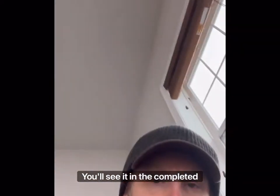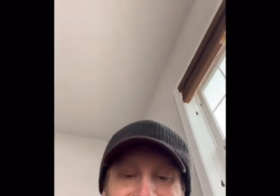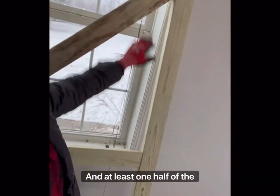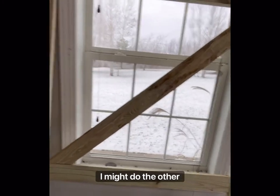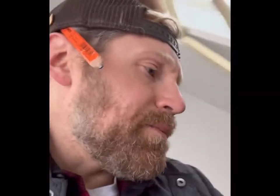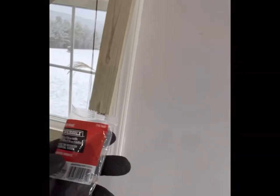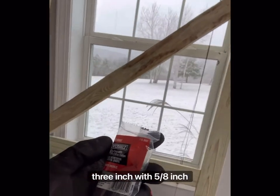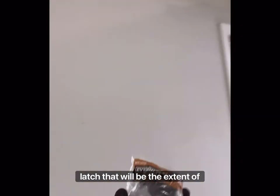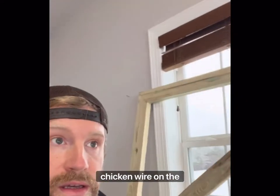I've got my hinges to put on as one of the last steps. Here's the finished door — I added a support beam in the middle and cut a diagonal on at least one half. I'll probably turn it around so the supported piece is on the bottom. I'm using three-inch hinges with five-eighth-inch radius — basic door hinges from Home Depot — and a gate latch. Once I get the hinges on and the chicken wire on the door, it'll be done.